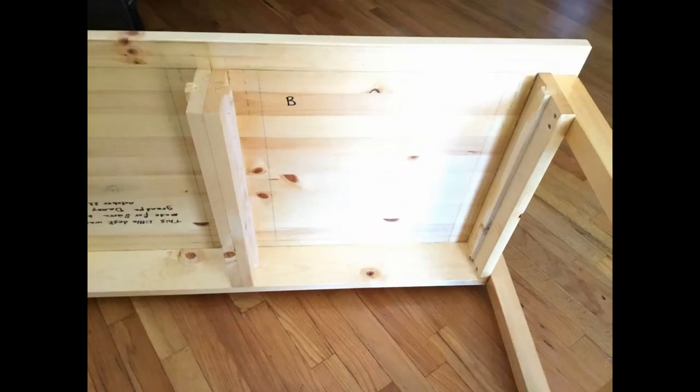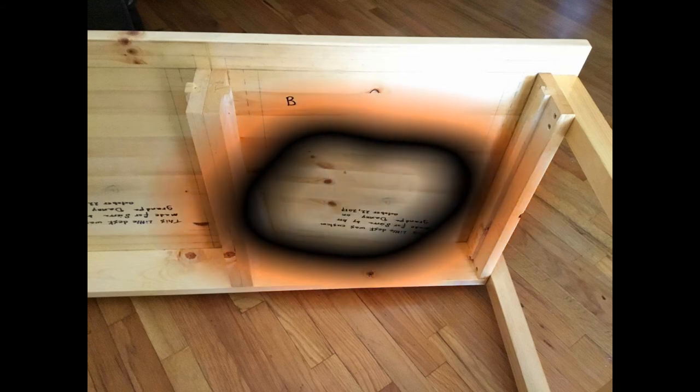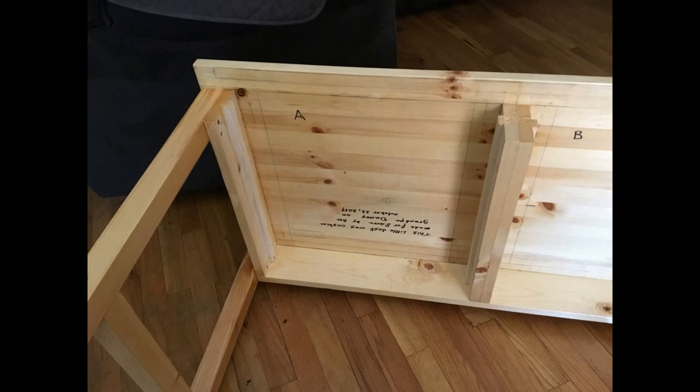So there's the front, the back panel, the leg, and the middle support for the drawers with the three-quarter oak rail, a 3/8 dado. These are things that an average beginner could do. He could even nail these in if you wanted to, not make a dado, and yet not have them show. A biscuit joiner, this is a very basic structure a beginner could do. And I'm just showing how a biscuit joiner could greatly enhance its methods.